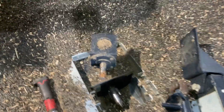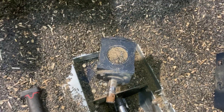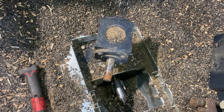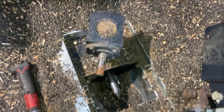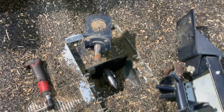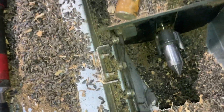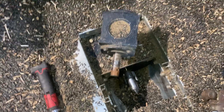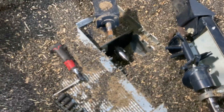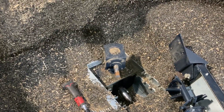After a lot of pry-barring, pulling, and tugging — here's the gearbox. The auger that goes down on that torpedo is pulled back, so now we're at the point where we can pull this gearbox or take a look and see why it's not engaging the floor sweep. You can see right down there there's a rod — that rod slides in and out and that's what's supposed to engage it.